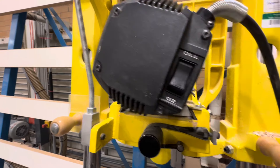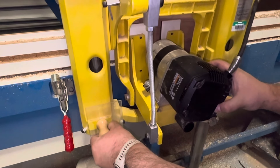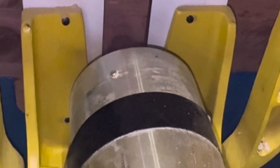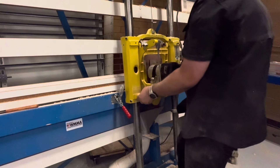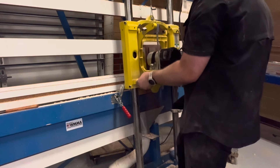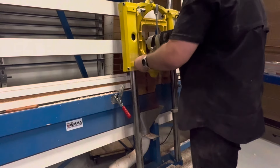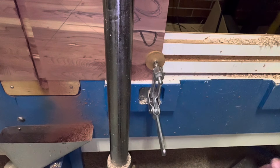First, hold the on button and bring the panel router to the very bottom. Start by chipping away just a little at the bottom and the very top. Be patient with your cuts, as it will probably take two to three passes to cut through all of that wood. After routing, remove the clamps.